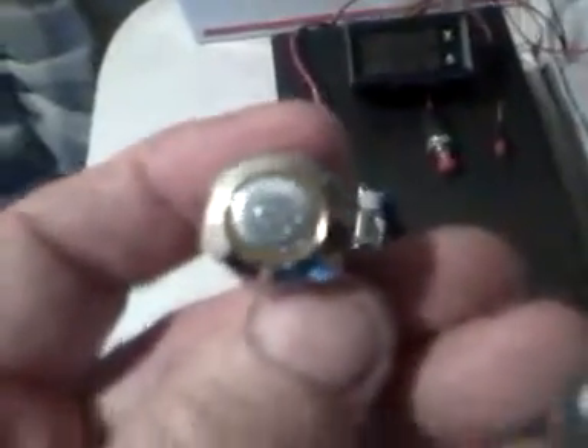This other switch, I'm going to use for my diversion device, whatever that may be. What that diversion is — I really like this — because what happens with this diversion controller, if you hook it up as a diversion controller, your solar, wind, or hydro connects directly to your batteries. And then a couple wires come up from your batteries into this diversion controller.